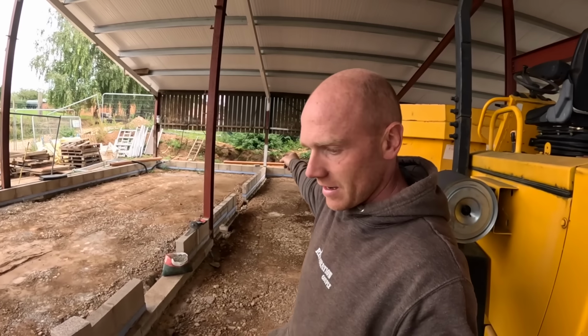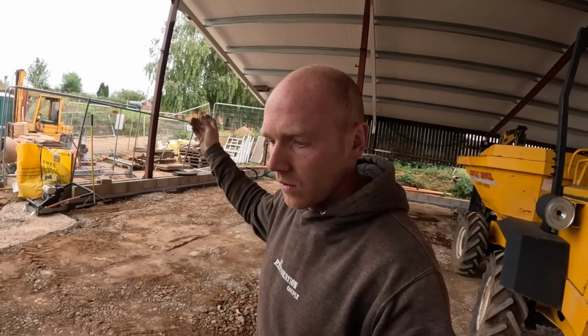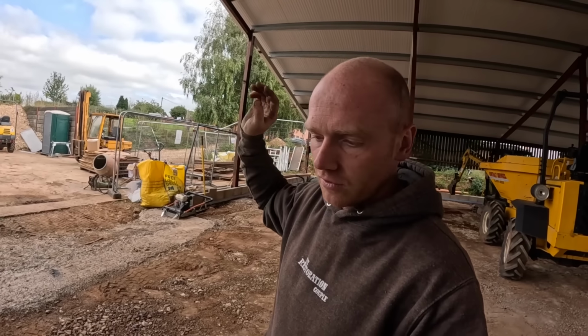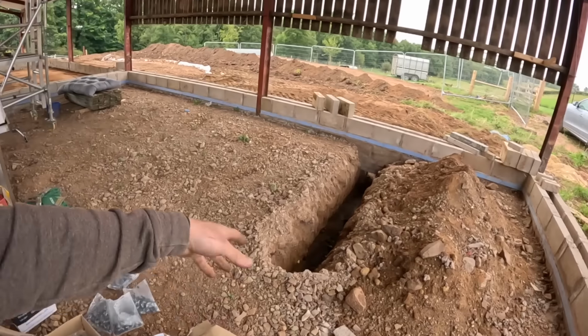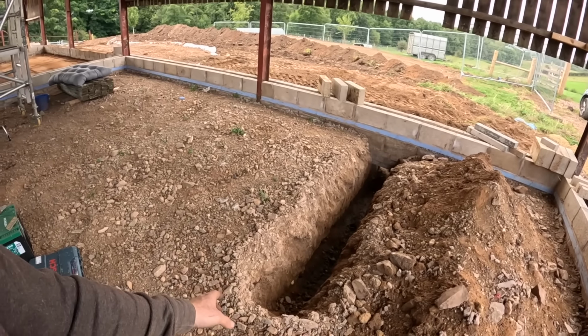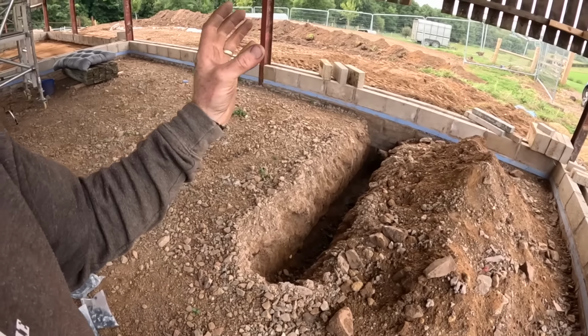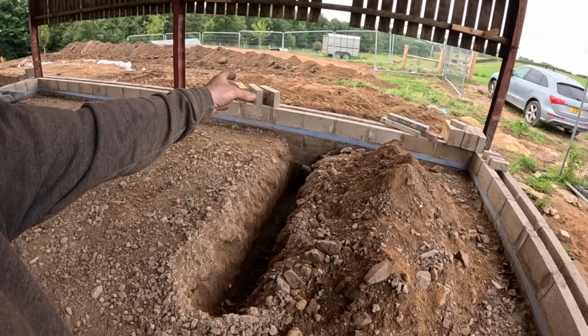So that has got its own little lintel. It's just a straightforward run, elbow with soil pipe. Rather than taking 40 mil waste out through the wall into a gully or whatever, we've just gone soil pipe under the slab everywhere. And then finally, last but not least, the kitchen. This we dug ages ago, but that's going to be the island, a pipe coming up for the island, and then a pipe dropping down into it underneath the kitchen sink.